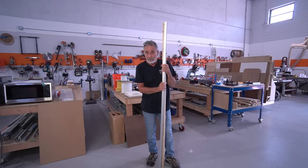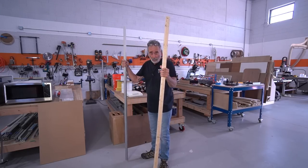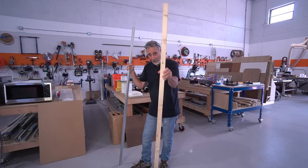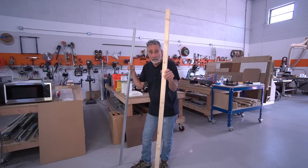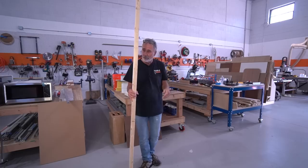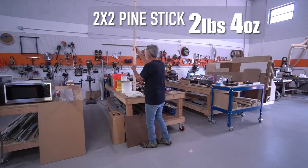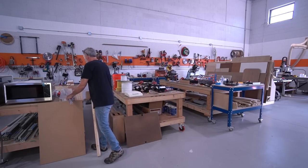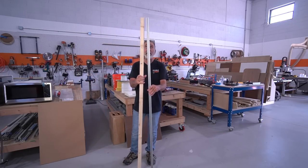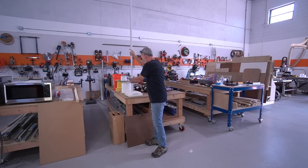I need to make a project out of 80-20 versus plywood versus wood construction. Most people — most DIYs and a lot of professional builders — will use two-by-two stick framing pine. This is garbage wood; it doesn't hold a screw, it splits most of the time, but that's what they use. This piece right here is 2.2 pounds, and I cut it to the same length as one of my 10-series 80-20 pieces — both exactly the same length. Two and a quarter pounds for the wood, but you need a gazillion of those to get the same job done as one 80-20.